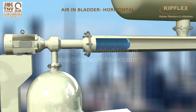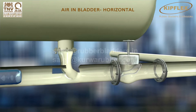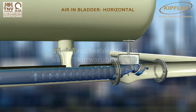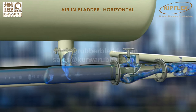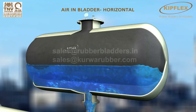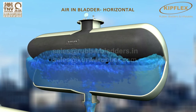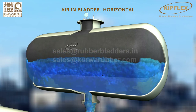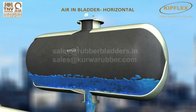When the pump starts, water starts flowing at its design velocity and the line pressure is generated. In case of any surge in supply or any other reasons, the valve will close and the water starts reversing back. With the surge pressure, the pressurized water will enter into the bladder tank and thus the additional pressure generated is absorbed gradually by the pressurized bladder.